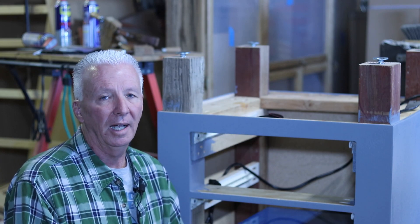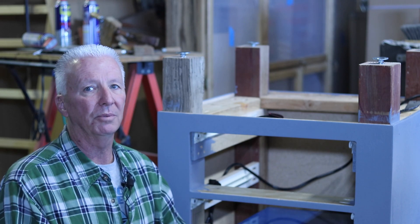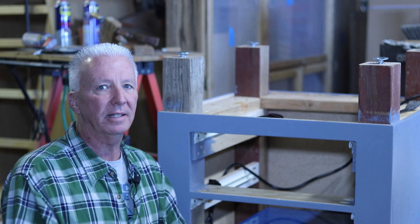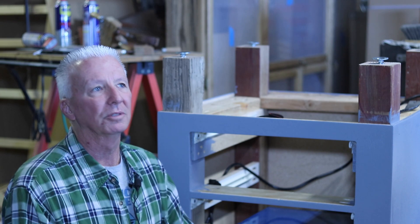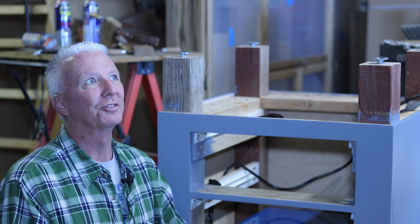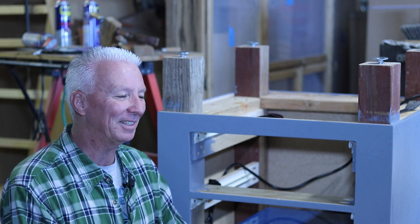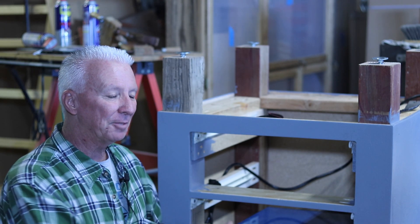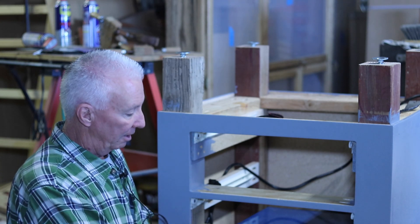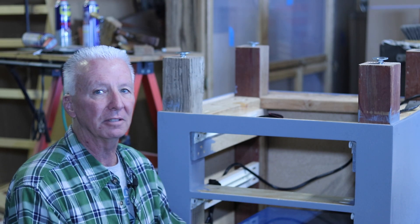Sure enough, I had a major gap in the front and back. I even went as far as to call Rockler and said, what's up with this? I don't see a fix-it kit or a retrofit kit or anything like that for this dust bucket. And the guy at Rockler was like, I don't see anything — ours is set in flush. I'm like, oh my God, I can't be the only person getting the wrong tabletop here. So I did this whole stinking video, even spent three hours making custom-fit pieces of wood to go underneath the cast iron router tabletop to fit against the dust collection bucket to seal it all up.